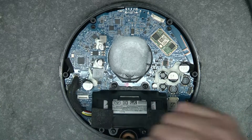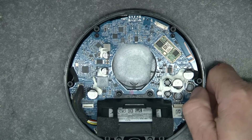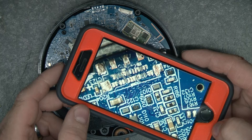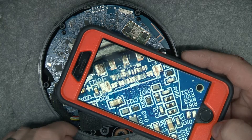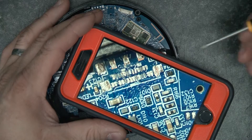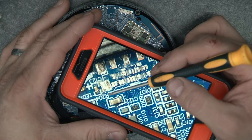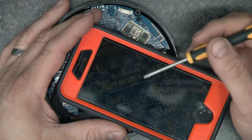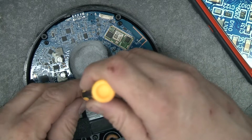Obviously this is a class D amplifier, Bluetooth receiver. I'm not sure what all this is doing — it's probably charge management or something, and it looks like it's got another jack of some description there. As we can see, there are the terminals that have pulled off and unfortunately some of the pads have lifted. So it does look like we're going to have to find somewhere else around here on the board to connect the 5 volts to. When we're looking at this here we can see off this terminal there's quite a thick cable coming off it to the end of this capacitor, and the ground there also has quite a thick track. So I have a suspicion that if we inject 5 volts there and there — onto this pad here and this pad here — we're going to find that it will power up. I think what I'm going to do is take the battery out and take the board out.